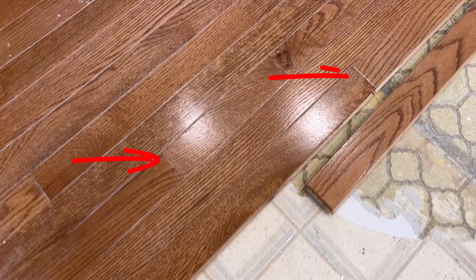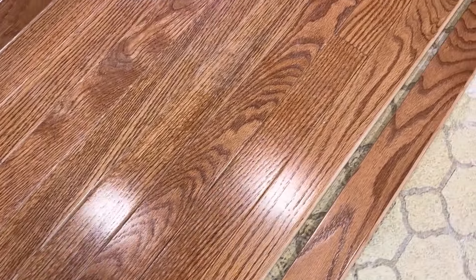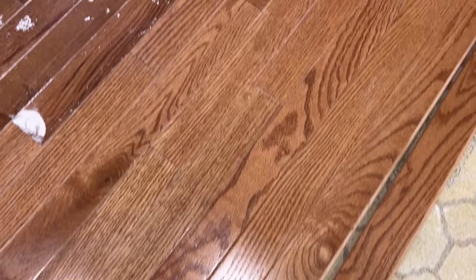Here's what I'm talking about having the butt joints line up. You'll see here I have them staggered pretty far apart. I like to have at least three boards apart before they start repeating again. Even then I don't have them exactly lined up — they're about an inch or two apart. It may not always work that way, but that's where I like to have them.